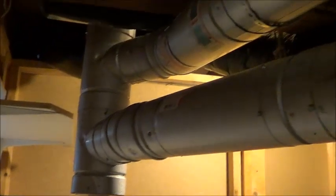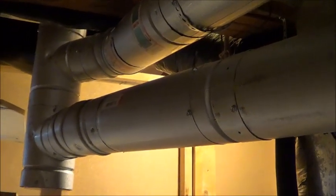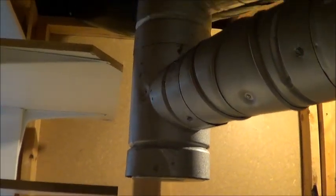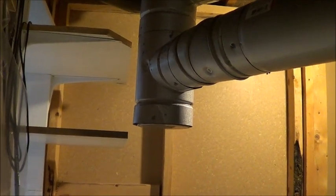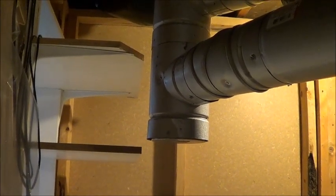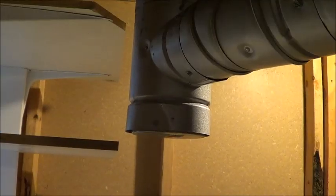The problem is it's incredibly dangerous. While your fan is pumping nice clean air up into that duct, the other two pipes are feeding things like carbon monoxide into that duct. Every single chimney duct is only designed to handle a certain amount of air pressure. If you try to overload it, you end up creating backflow — and that means carbon monoxide flowing back into your house.